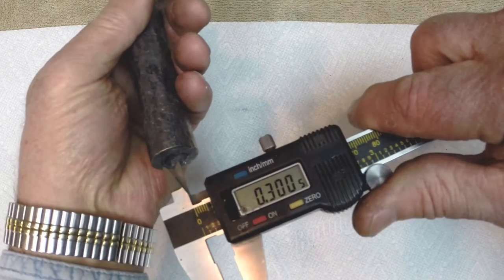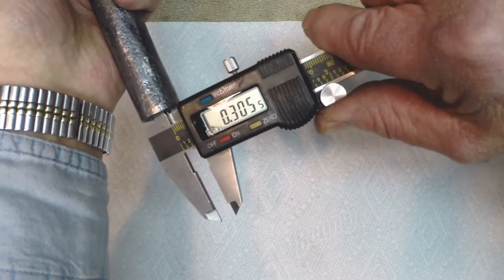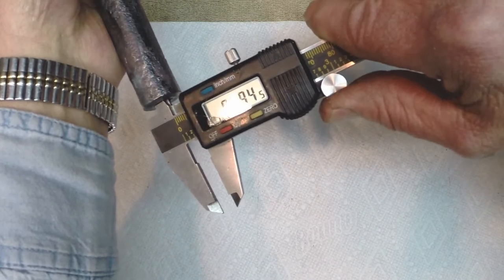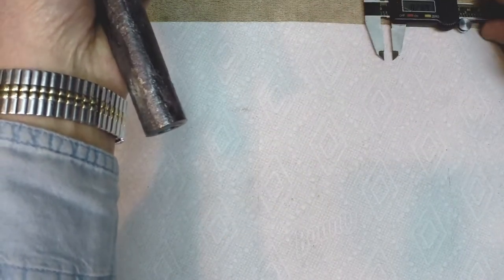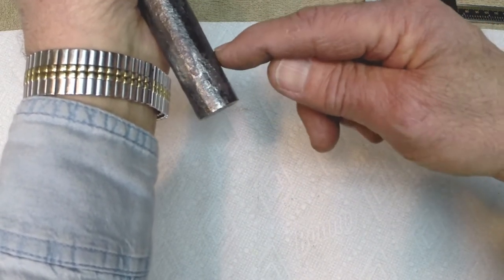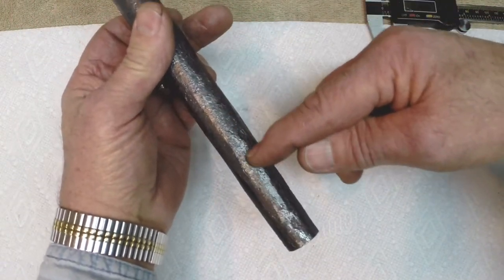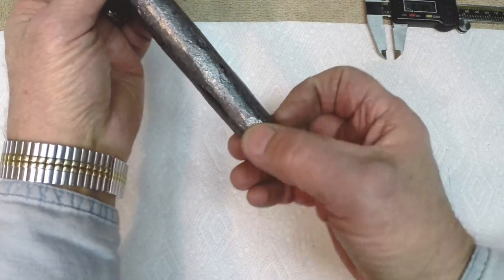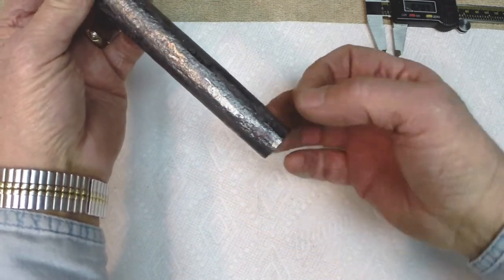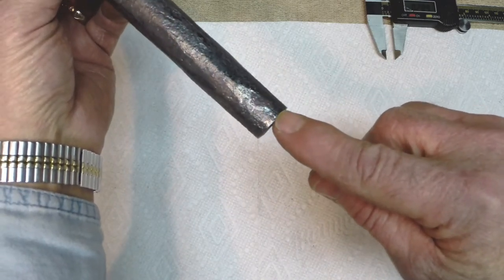The bore, which started out at 440, out here at the muzzle, it's measuring about 0.270 or 0.280 or so. But I don't have the muzzle forged down as far as I want to go. It's forged closer back here. I put a 1/4-inch rod down this thing, and I could just barely get a 1/4-inch rod through this area here. I didn't want to forge too much out on the muzzle with the trip hammer because this stuff is so soft, I was afraid of crushing it. So my intention is to forge it down smaller here, and I'll finish the muzzle with a hand hammer.